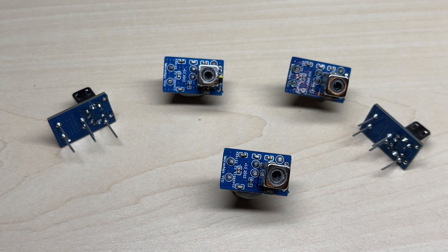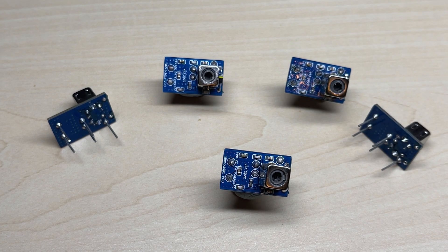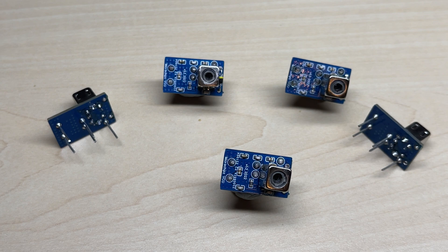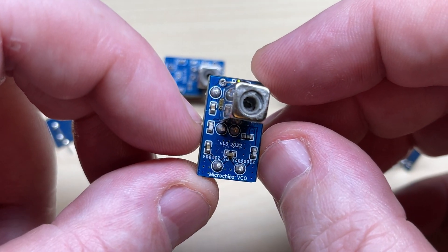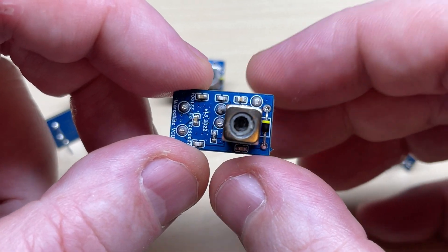Now in true Microchips fashion, as you know I don't just stop at one thing — I like to carry on. We've made a surface mount version of this VCO just to see whether we can actually do it. Unfortunately I have to hand solder these because these boards are too small to go through the surface mount machines at the board manufacturers. So I've been learning how to solder 0603 components, but once you get the hang of it it's quite easy. This VCO uses exactly the same value components, just obviously surface mount, and this board is a lot smaller.